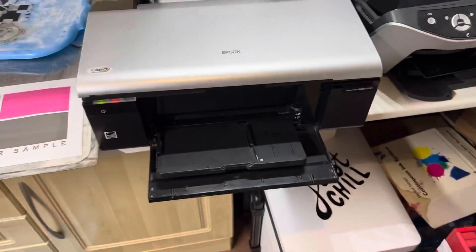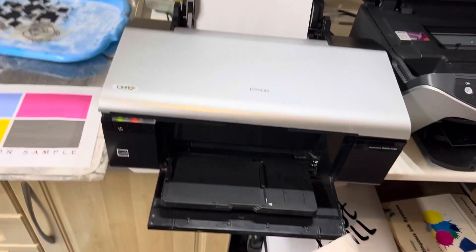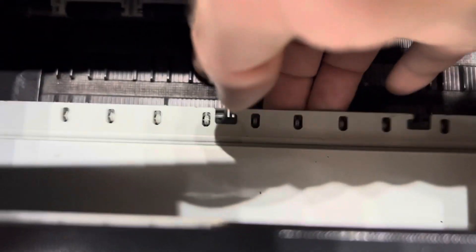The paper is too thin to be printing that much ink on, but basically Acro RIP is being told to print cyan, magenta, black, and yellow, with light magenta and light cyan as the white base. The whole thing would have been white. If I was loaded with DTF ink that would have printed fine, but as I said, the pizza rollers on the front would have destroyed it.